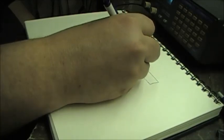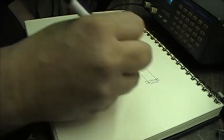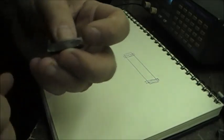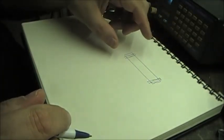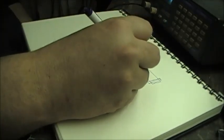There's the LCD there, and underneath the LCD there are two black - or I should say two plastic spacers basically. They just help support the LCD. Those had to be removed - two of them like this. Easiest way to remove them is just snap them off, so you get rid of those. Then you're just left with the pins on the LCD soldered to the board. There's a piece of foam right here protecting the LCD, and that foam also had to be removed.